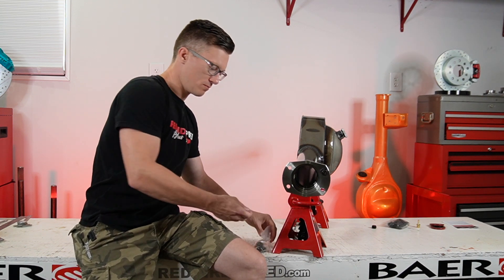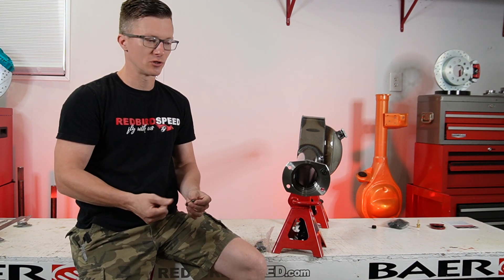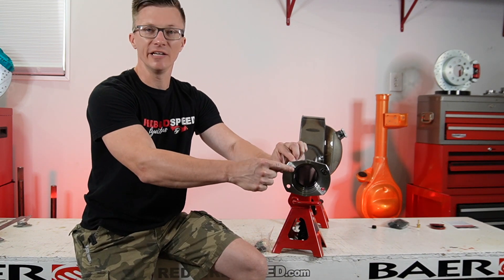Just like they sound, they got a T-head on them — a sideways T-head. Three-eighths, 24, comes with lock washers and nuts. What these do: they come through the back side of this housing end, and when they go up against that housing end, they won't turn because they got this T-head on.